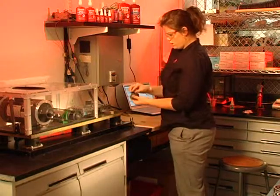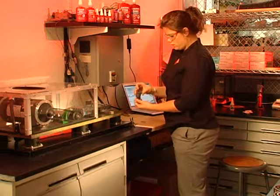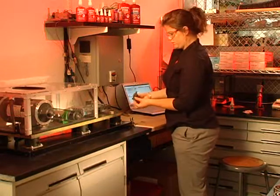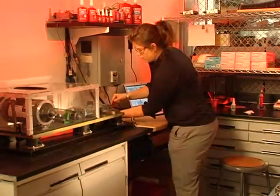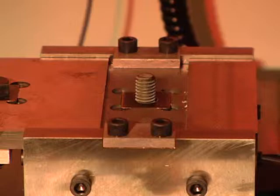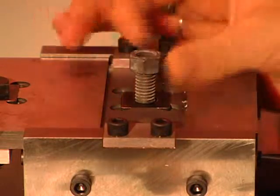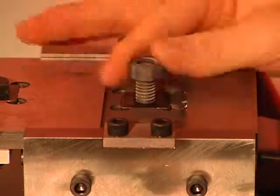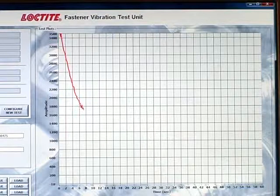The Junker's transverse vibration loosening test provides a simplified method for broad-scale testing and inspection of the transverse vibration or loosening properties of fasteners. The Junker generates relative motion perpendicular to the axis of the bolted assemblies. A comparison transverse vibration test is designed to expose two or more fastener sets to identical test parameters, allowing the technician to determine the effects of a single variable on a bolted assembly.